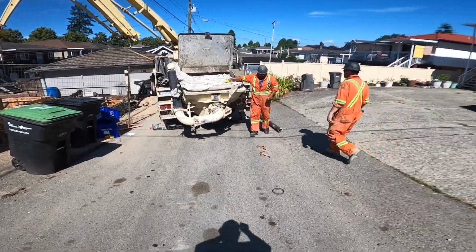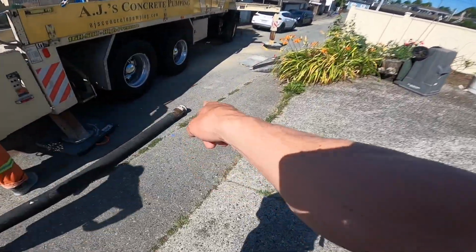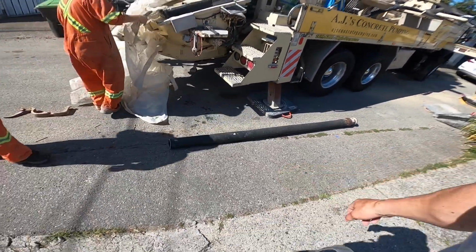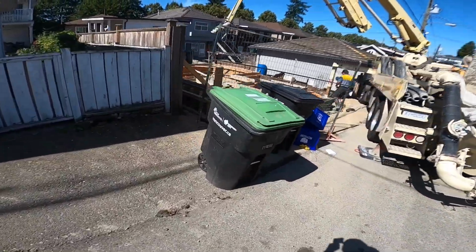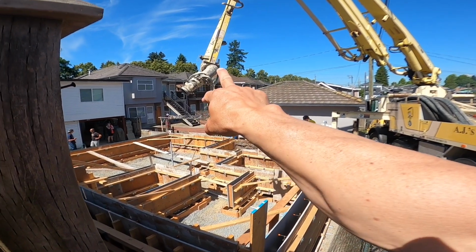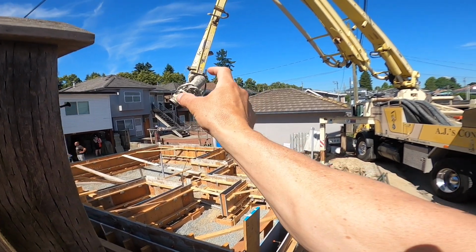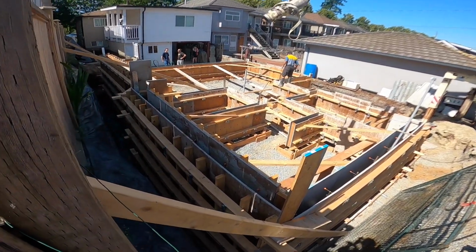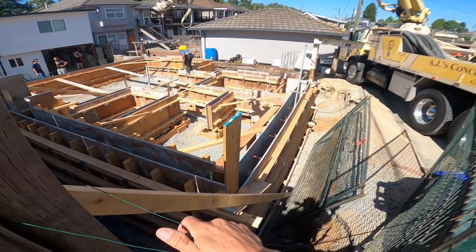So yeah, we're gonna use, as much as I don't really like these hoses a lot, it's got a 4-inch flange with the 4 to 3.5 reducing stem. They can be Plug City, but this is just a nice creamy residential mix, and we're not pumping fast. But typically that hose coupled with the short 5 to 4-inch reducer that's a 12-inch or 14-inch. So you're reducing down from a 5-inch elbow to a 3.5-inch hose in less than 2 feet. Not ideal if you're trying to hog out 10 loads on a commercial job, but for something like this, it doesn't matter.